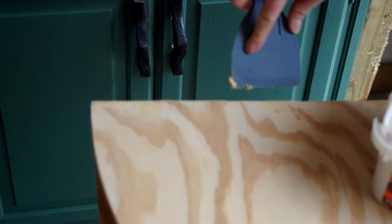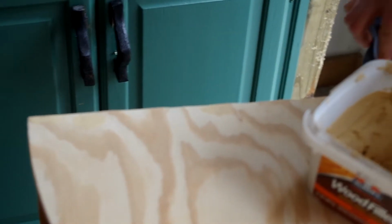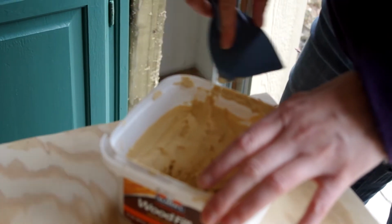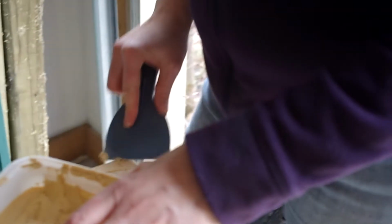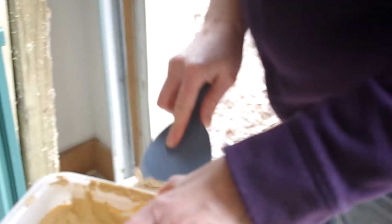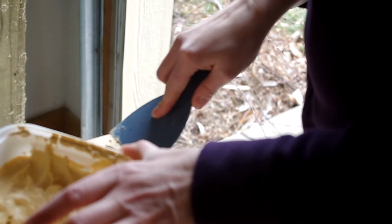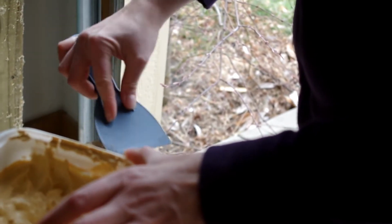Now you have to find every nail and every screw, whatever you used to put the project together, and also any imperfections. So I think that knot there probably needs touching. The idea when you paint wood versus staining it is that it is as flat as you can make it. Correct? Yeah, you want a smooth and nicely finished surface.